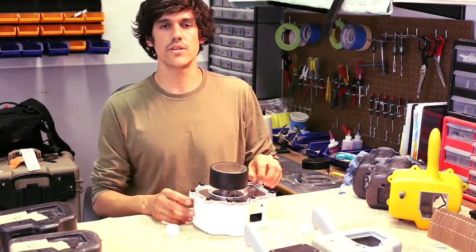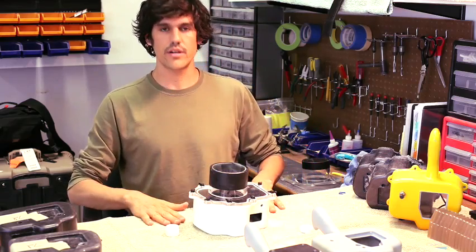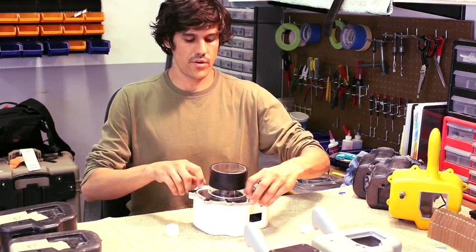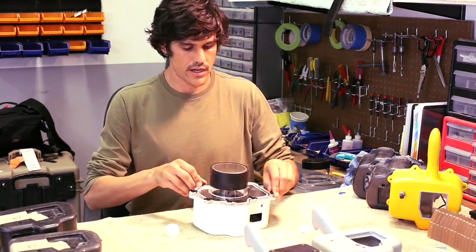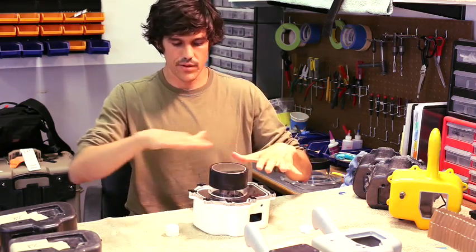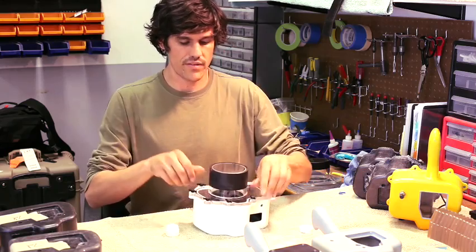The best way to do it is in a star pattern. Usually what I'll do is just do little 1/8 or 1/4 turns. If you've got 2 hands in your housing on a towel, then you can alternate and work your way around. For the most part, you're just doing tiny little increments of tightness, and that's compressing your O-ring nice and evenly to keep your port nice and flat, so you're not stressing anything out apart from how it should be.